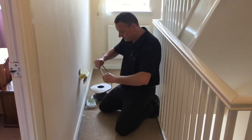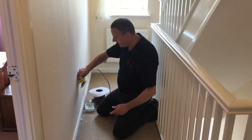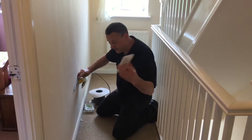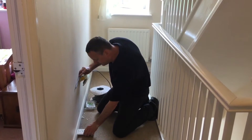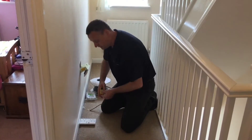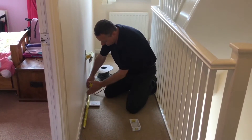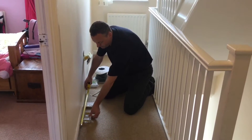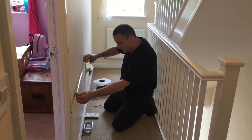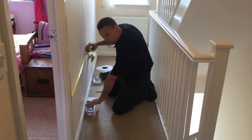If I insert something rigid - in this case a 2.5 cable will be perfect - I can push it in until it hits the side of the strut. So it's hit the strut at that distance. If I use my socket outlet on the floor, I can position it as if it were the upright, then work out 400mm - which is roughly the gap left between the uprights - and position my box accordingly.